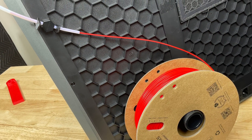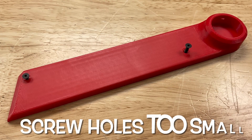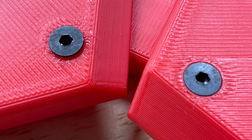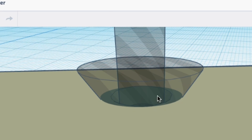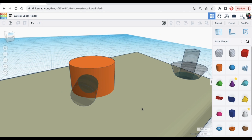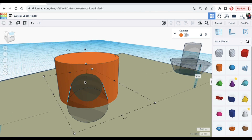The spool holder is at the back and there's also a PTFE guide held in place by some clips. I want to see if I can incorporate that into my design. When I downloaded and printed their design the screw holes were a little bit small, so I want to improve that. I also want to make the screws fit flush, not pop up like theirs did. I brought the design into Tinkercad — my favorite tool for modifying 3D prints. I'm going to modify both holes; the one on the left I'm making more of an oval because the holes didn't exactly line up and I wanted more play to adjust it. I cut the grooves deeper so the screws fit flush, and then I made a post with a 4.2mm hole through it for the PTFE tubing — slightly bigger than PTFE but with rough edges so it grabs the tubing.